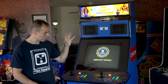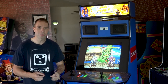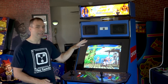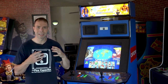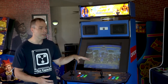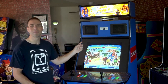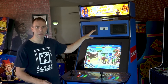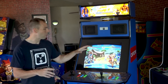What I ended up doing was a bit of a jimmy-rig. I decided to say screw the QSound amp for the MiSTer — I'll leave that with the CPS2 stuff. I had a few inexpensive car stereo amps laying around, so I grabbed one of those as my amp for the MiSTer. Then I had to wire up a power switch to the QSound amp, because you don't want two amps going simultaneously into the same speakers. Since the QSound amp is hardwired at 120 volts and always on, I snipped those wires, wired in a power switch, and ran it up to the front of the coin door.